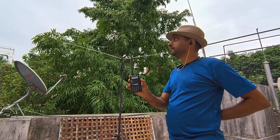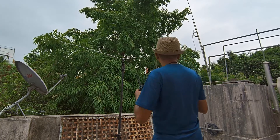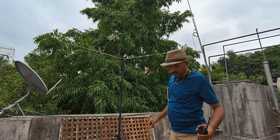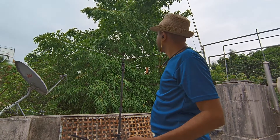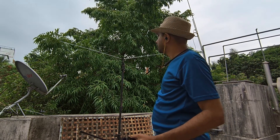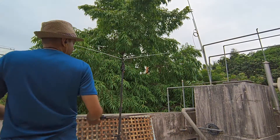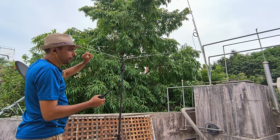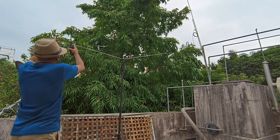We are very close to 1 now — maybe a little bit more and we'll be okay. When I touch the antenna, the SWR goes high, so for a few seconds it goes back to its original slower pulses, but then it comes back again to the higher frequency.